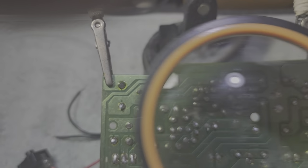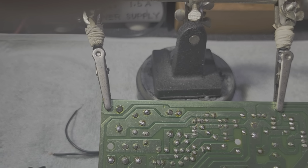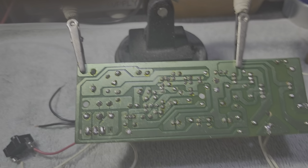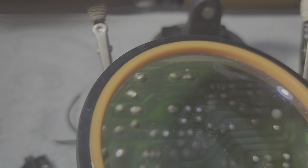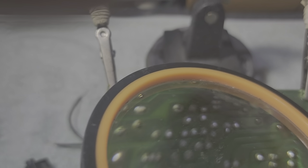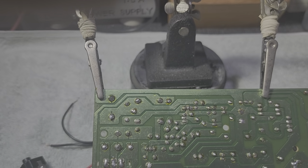that short circuit thing. So actually, after scraping, try to brush it, okay, then try to observe by using the magnifying glass if there are shorts that happen when you did the soldering, because just in case there are some unintentional short circuit, you will be killing some of the parts of the circuit and much more. You could not troubleshoot the circuit.